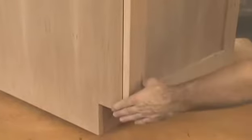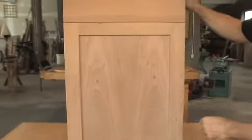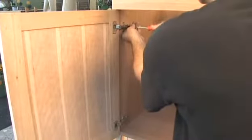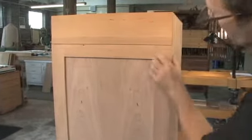Overlay doors are typically seen in modern kitchens, although they work equally well with traditional furniture. Along with overlay drawers, overlay doors cover practically the entire face of the cabinets, offering a sleek and seamless look. Fitting this type of door takes some practice, as the gaps between adjacent doors or drawers must be exact, often an eighth of an inch or less.